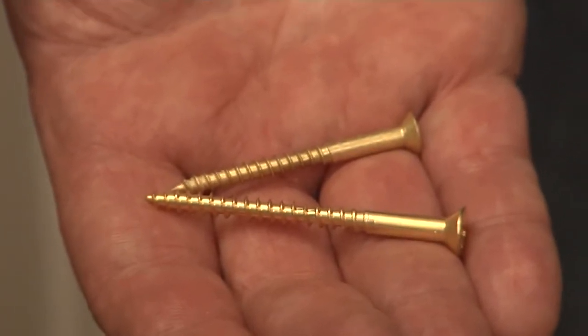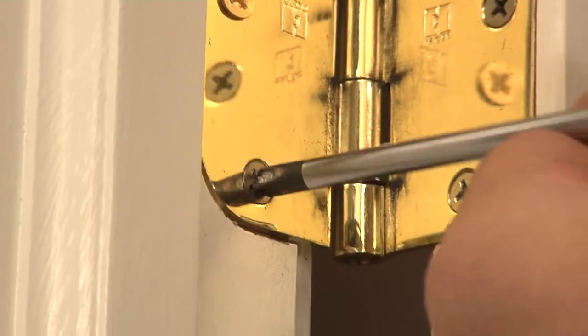Basically, what you want to do is make sure that door is plumb, meaning straight up and down. You can shift the door by removing a couple of the hinges, depending on which way the door has to go, and putting in a longer screw to tighten it up and kind of pull it back up. That way, wherever you place the door, it'll stay and your dog can come and go.